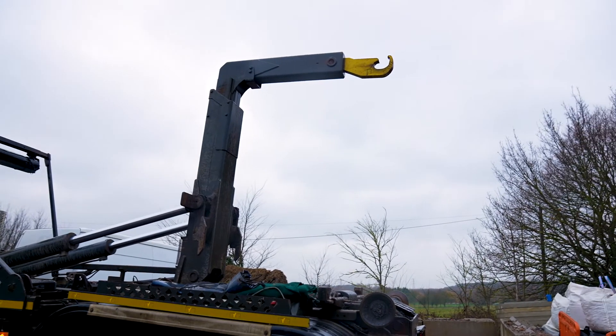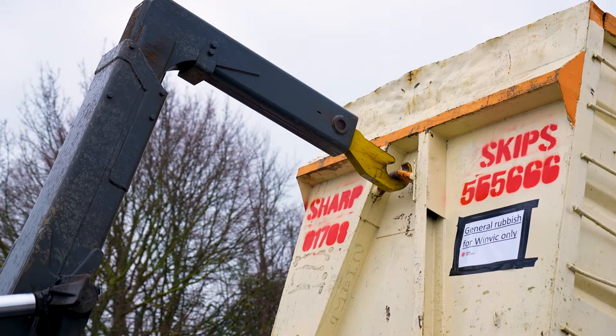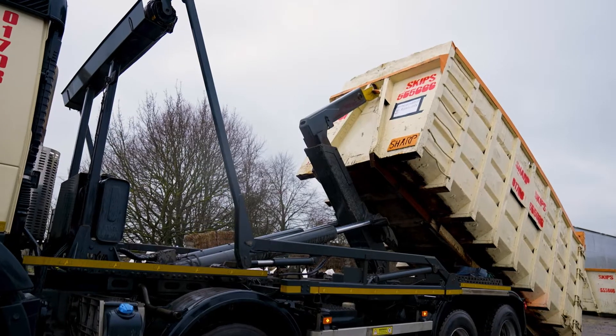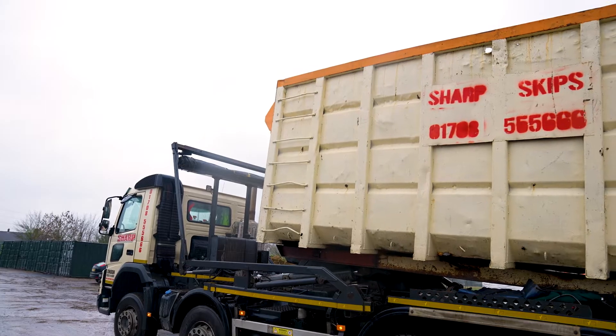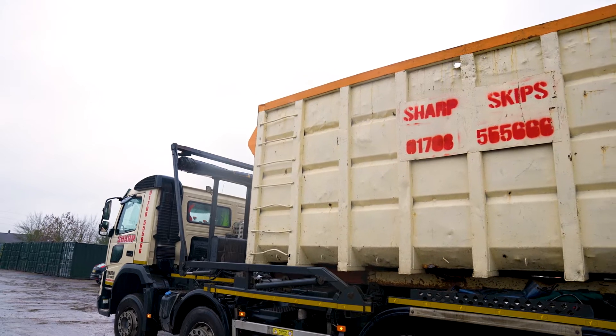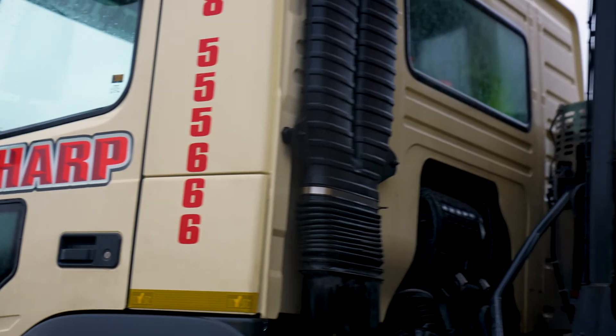The container will be left empty, but obviously on collection will be loaded, and the ground will need to be leveled. This is quite precarious when lifting the container if it's heavy. If the truck is leaning or the ground is unsafe, it can cause the ground to submerge, the truck to lean, and even on occasions can cause the truck to become unsteady and have to drop the container before overturning.